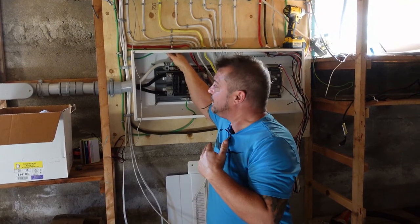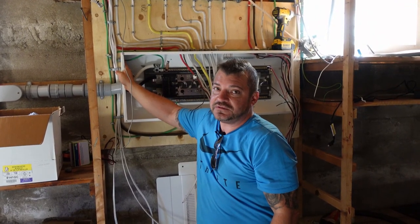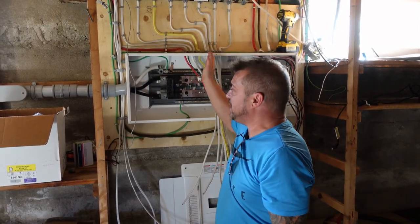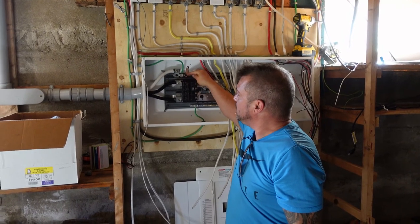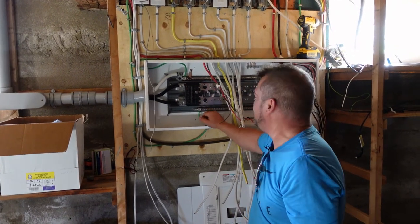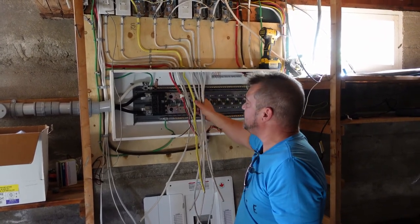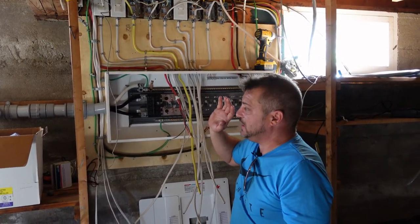In this situation we've installed a grounding plate — we dug it down two feet, put the plate in, took pictures of it for the inspector, and brought it in through. The ground from the ground electrode has to come in through the main compartment of the electrical panel and hook directly onto the neutral at that point of connection. There's a bonding strip here which goes from the neutral bar to the casing, and that has to be done at the first point of connection. All the individual branch circuit conductors come down from the faceless GFCIs and connect to the breakers.